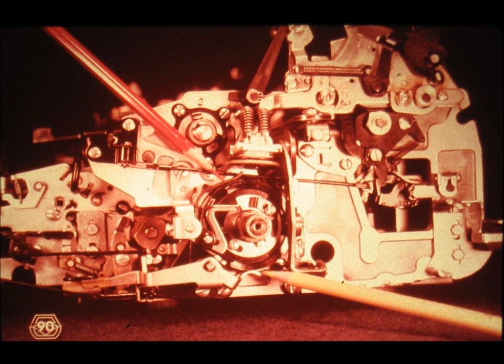Slide number 90. With all of these parts out of the way, it becomes easy to see the brake and the shift cam detent — the cam follower — the brake holding the cam in the lower case position, and the detent holding the cam in the upper case position. By now you may wonder why all of the fuss about who holds the shift cam in position once it has reached the lower or upper case position. Your question is a very good one. By now you know that the left end of the shift clutch spring is held by the shift cam retainer plate, and that the retainer plate is permanently mounted onto the shift cam.